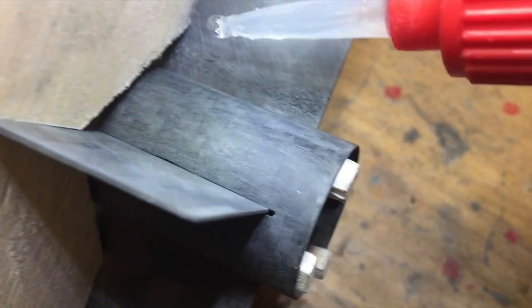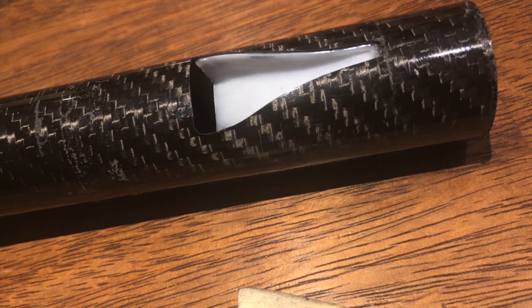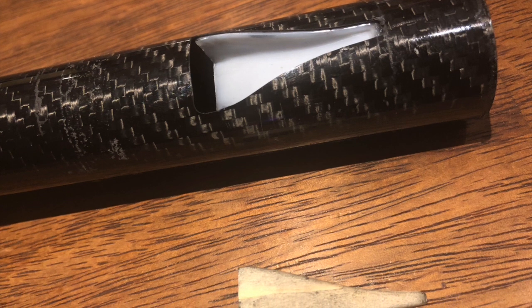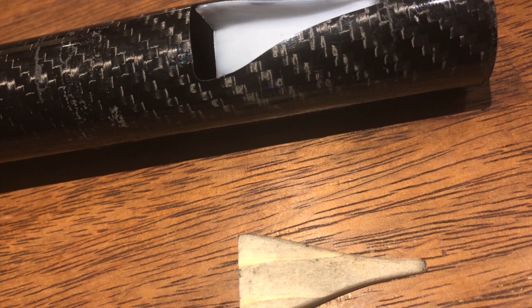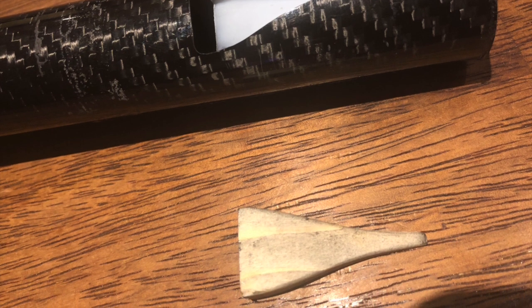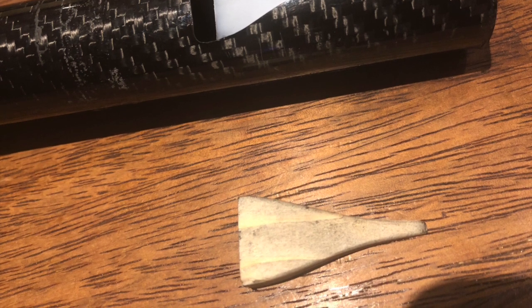As a way to have cooling airflow through the system, I made these NACA openings by thermoforming plastic from the outside. I made a wooden template, put the plastic on the outside of the tube, and with a heat gun heated it, then pressed it through to form the NACA opening, and then epoxied it in from the inside.